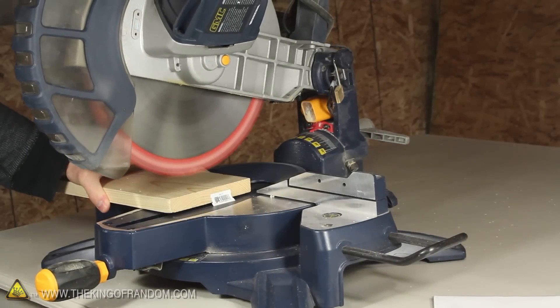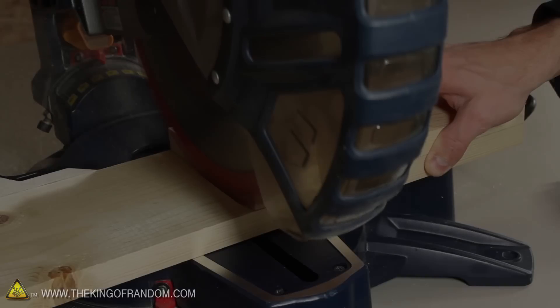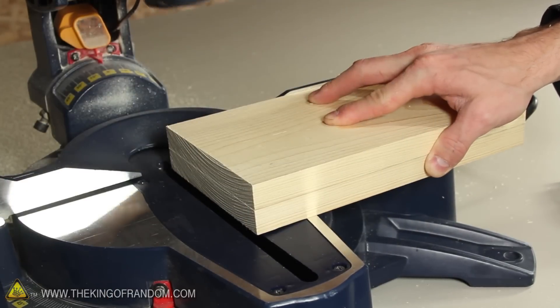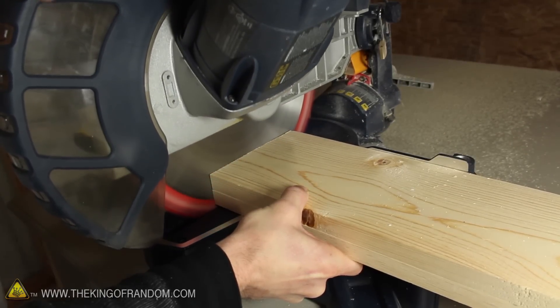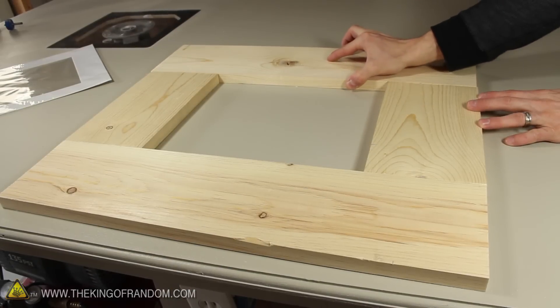The first thing we need to do is cut a small piece off the end of the board to make sure the edge is straight and clean. Next, let's cut two pieces to custom heights — by ripping the two boards at the same time, you can see they end up exactly the same size. The other two pieces are cut using the same method, but they're quite a bit longer because the frame is pretty thick, and these are going to form the top and bottom.